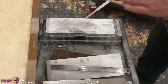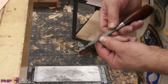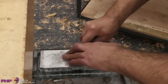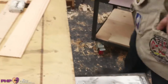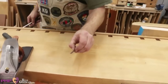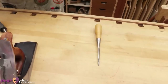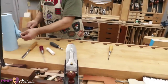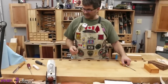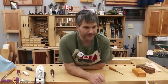And then the advantage of our eighth inch is we make them from a quarter inch, so you've got a lot more reference surface when it comes to polishing and grinding the back. Because these ones like that have a tendency to roll on you when you're trying to do the back. Probably the biggest thing is just a really light touch. Just learn to have a really light touch so that you can hopefully feel through your fingers and be able to tell what's going on.